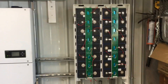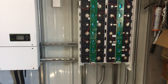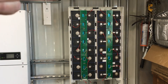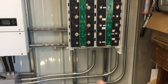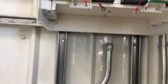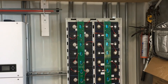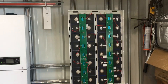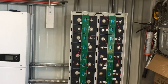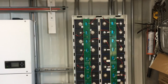The battery enclosure is mounted on the wall and I've installed all 16 of the cells, along with the linker bars which hold the batteries into the enclosure. Now it's time to install the bus bars that jumper between each cell through the stack. These cells are quite heavy — the cabinet with all 16 cells is just over 200 pounds, so installing it on my own on a benchtop wasn't possible. That's why I put the enclosure on the wall first and then loaded the cells in individually.